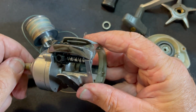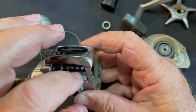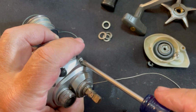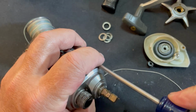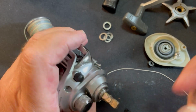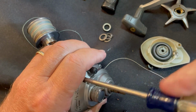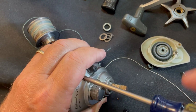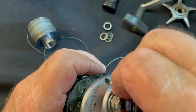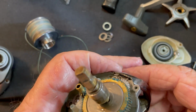All right, we're going to have to take this back apart. Something came off? There's too much grit inside the worm gear. And on top of that, as I was trying to get it out, I used a Q-tip to try to get some of it out, and it hooked on the point of it and pulled it down in there. And I can't leave that in there. It'll just bind it up. So we're going to go through and pull that out real quick. And remind me, Mario, when we go put this back together, to make sure that I put those back in there. Mm-hmm.